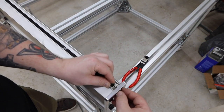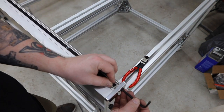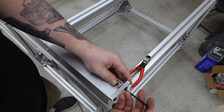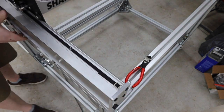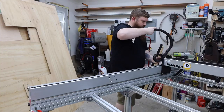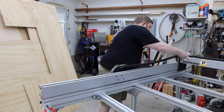I ordered a roll of 9mm wide belt off Amazon just to get the machine going for now. The proper tension is guitar-string tight. I adjust the belt so the threads just catch in the bracket. The hole in the riser bracket is slotted, and I noticed it needed to move a little inwards to keep it aligned with my pulleys. I added a few pieces of cable chain to the original XXL one, adjusted the length until I had it just right, and used a self-tapping screw to hold it to the extrusion.